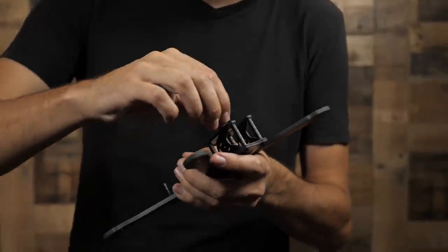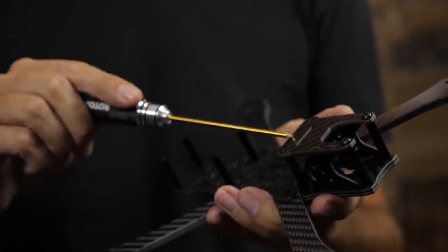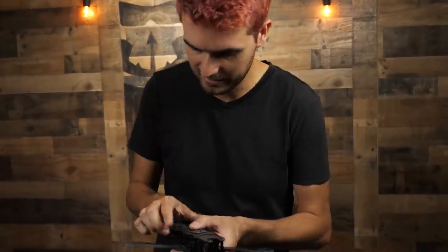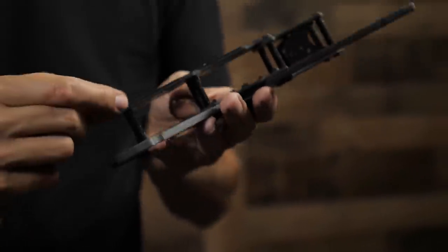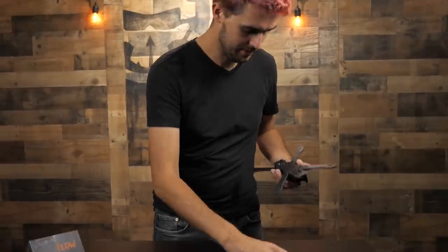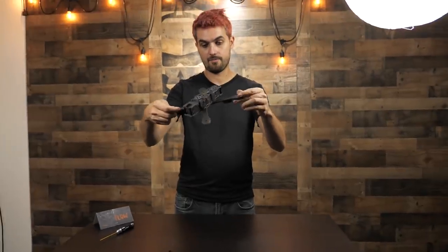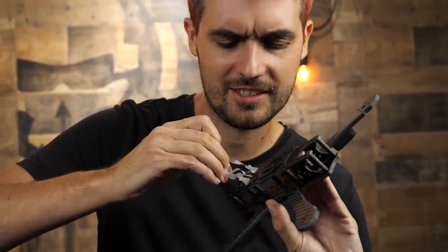With the camera plates in place, grab the front section of the top plate and insert it onto the vertical camera plates. Thread two short screws into the two front standoffs - don't do the second set yet because those screws need to go through both top plate pieces. Grab the rear top plate piece, get it in place, then pass two medium screws through both pieces of carbon. Finish with the remaining short screws. If you like the little landing feet, peel the backing and stick them on the bottom of your arm - frame is fully assembled!